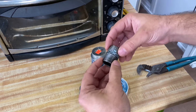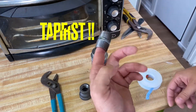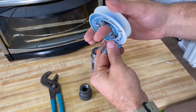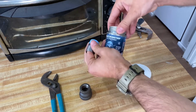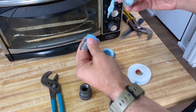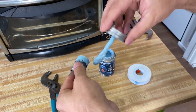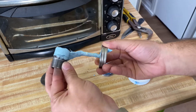I'm going to do this over here before I connect it to my actual fitting — that's going to make it much easier. I'm going to place this pipe inside there. In my left hand I'm going to apply the Teflon tape first, wrap it around about three times or so, and then get some Blue Monster. This is Blue Monster tape and Blue Monster pipe dope. Now that that's on there I'm going to apply this evenly all the way around. It's going to be much easier to do it off of the actual fitting if at all possible.